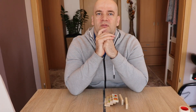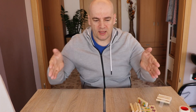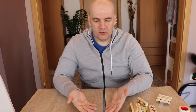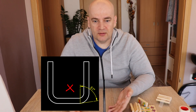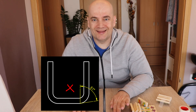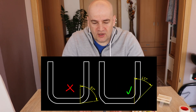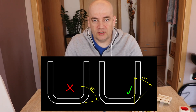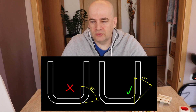A few examples about this technique. Imagine you want to print a box and you want all those edges to be rounded, for example 1 cm. You cannot start the printing from the bottom with that angle because the overhang angle on the surface is almost 90 degrees. What you can do is start with 45 degrees and then continue with the rounded edges, like here in this file I am showing you.